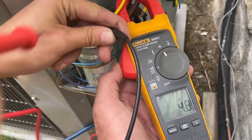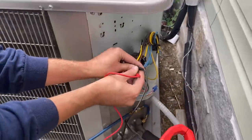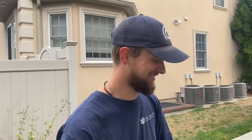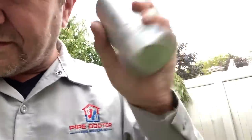Check between C and FAN: 4.9. Go back to HERM: 12.5. It's not within its rating - if this is a 65 and it's reading 12.5, what does that mean and what is that going to prevent operation of? Peter got the answer! Today is a marvelous day - September 30th, 2022. We'll get a 65 dual capacitor replacement.